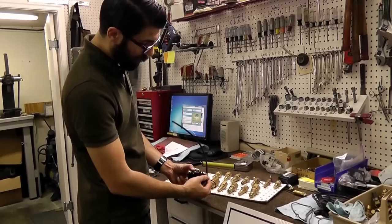The outlet thread on the bottom is what threads into the tank itself, so it depends on the size of your tank inlet. To measure these standard male pipe threads, measure the very outside diameter — here it measures 3/4 inch outside to outside. Then subtract 1/4 inch from that measurement: 3/4 inch minus 1/4 inch equals 1/2 inch MPT (male pipe thread). So you have a 1/2 inch MPT by 1/2 inch male compression with a 1/8 inch female port on the side.